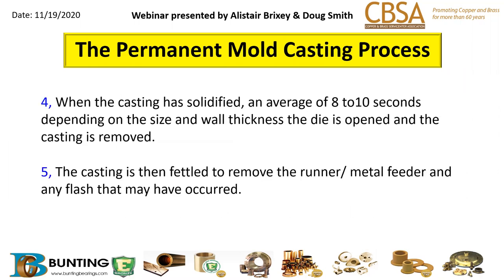After pouring the metal in, we have to allow it to go from a liquid state into a solidified part. Typically it takes eight to ten seconds on average, but it can vary depending on wall thicknesses and the alloy. Essentially we're taking a liquefied metal, pouring it into a cavity, and we need to allow it to solidify. Once it's hardened, we open the die back up and pull the part out to restart the process.